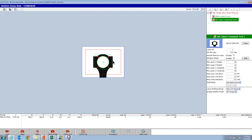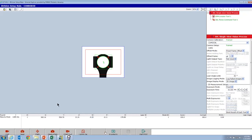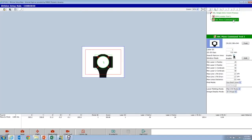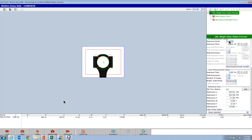We'll put it all together — snap and find. There is the 3D position of the part on the table. We're going to use that as our reference position. One thing I'm going to do is turn on the 'search narrow area' setting, which makes it a little more forgiving in finding the laser points once we start tilting the part around. So there's our 3D vision process — we've created our GPM and our laser plane. Now we're going to go back to the TP program and finish the program.